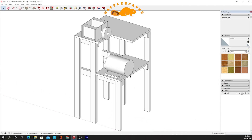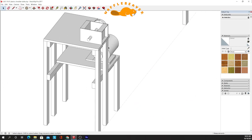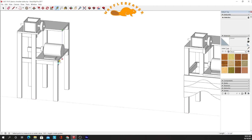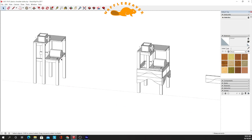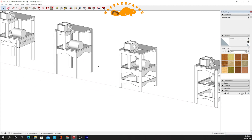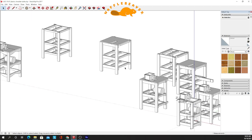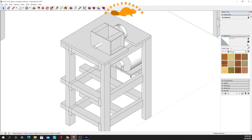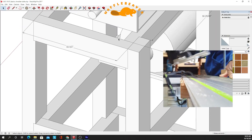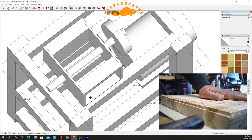From the design I sometimes do in Procreate, I start with a simple box construction — something like two-by-fours — two platforms separated by the elevation I'm looking for, which is 13 and three-quarter inches. I tried to get fancy with sine waves, but the more I think about it, the more I realize it doesn't need to be that nice. I keep making iterations and end up adding rabbets to make it easier to assemble alone with as little clamps as possible, just glue and screws.